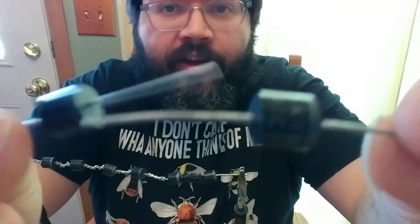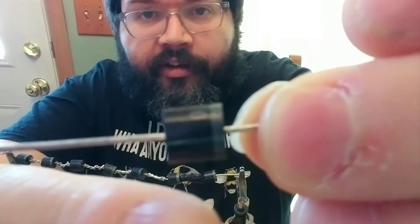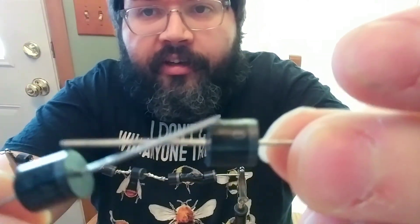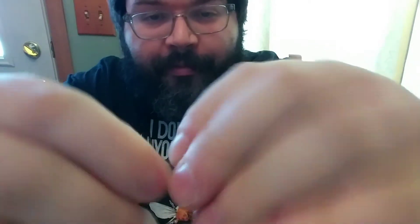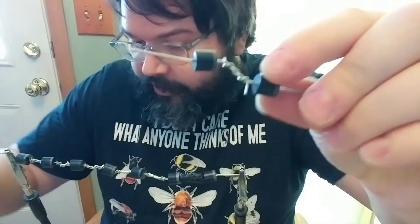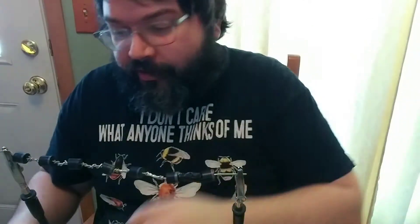To combine them, you're going to have to wire them in series, head to tail. You twist them together - notice the line on the diode? You go head to tail like that and twist them together, like you're twisting a twist tie on a bag of bread. You're going to need a pair of pliers to finish the job because it gets kind of small towards the end. Just finish wrapping that around with the pliers. You do that for all seven of them, head to tail.